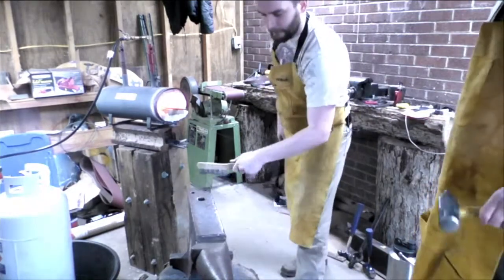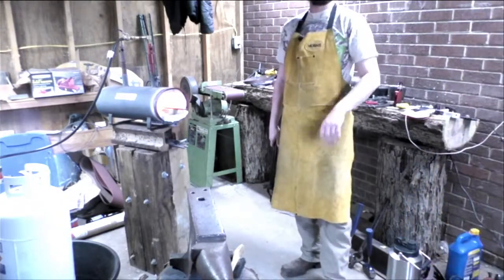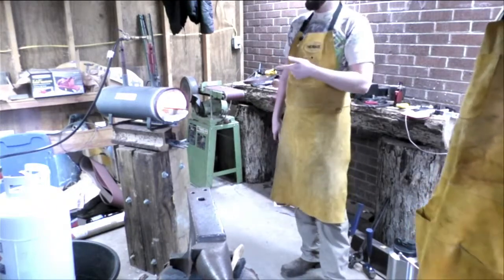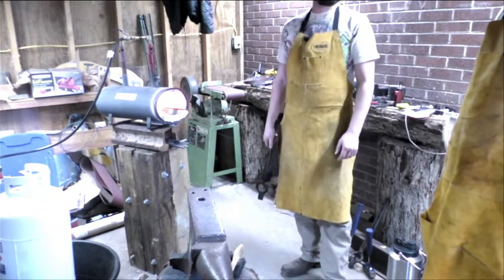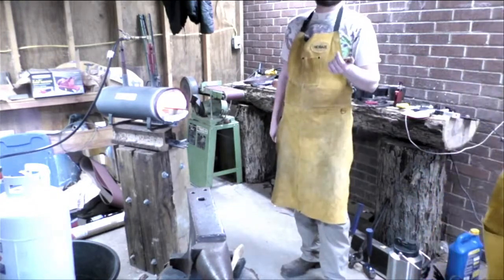It's always good to clean off your anvil face, keep it from all the scale buildup. You can see just all around it. It keeps it from re-impacting on the metal and holding onto it. The scale's good for insulating. That's all just rust. It's been rebaked because propane has water vapor that burns off. I like coal or coke because it keeps it from doing that as bad, but it does make a nice patina.